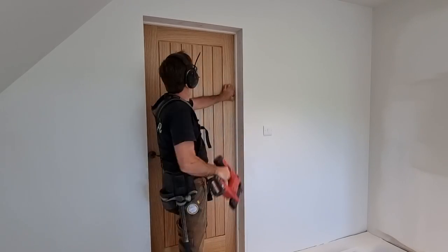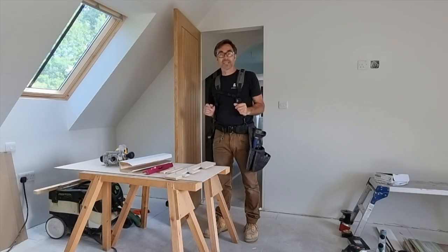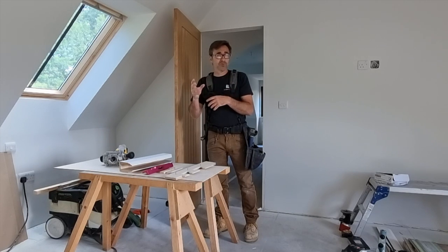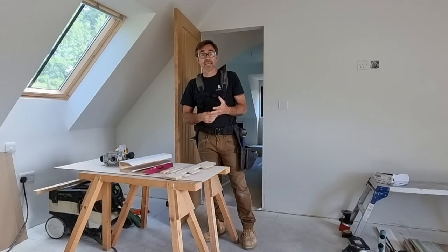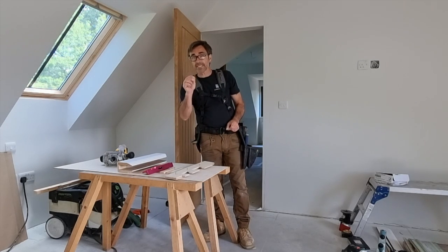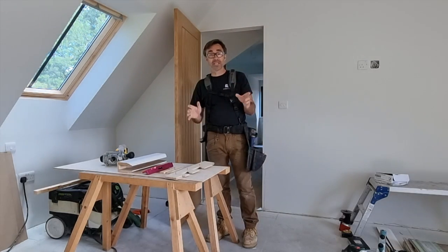Once that's done you're ready for your architrave. Because these are pre-finished doors, we then remove all the doors and stack them again prior to putting the handles on — that's the very last job once decorating is finished. You can put them on at this stage and take them off, but I personally think you want to pilot and fit them one set at a time so you don't muddle up the screws. It's all about being organized, having the right tools, and if you don't want to make jigs, you must have super sharp chisels — it's oak, it's a hard material, so mark it out properly and take your time.